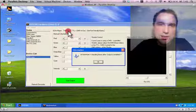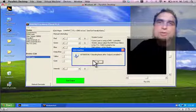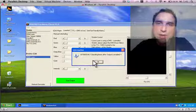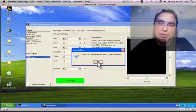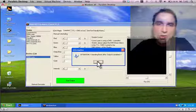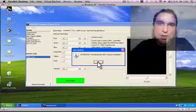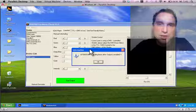The next step is the laser test itself. You're able to measure your exact power of each single diode on this way. It is not possible to have a measurement in the show itself because the laser modules are blinking on and off the whole time, and your power meter will not get the correct values in this moment. So this laser test will help you to find out the correct power of each single module.